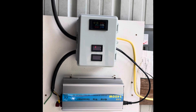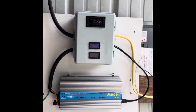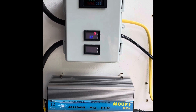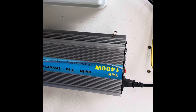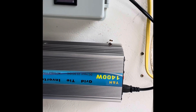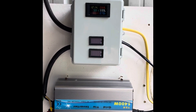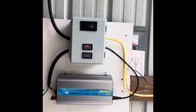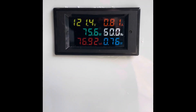In the future I had another setup here so I can get twice the amount going in. This will never overpower what's currently being drawn in the house, so it'll never be pumping back out to the power lines. This does have a safety feature that cuts off if it loses AC power from the grid, so you're not pumping power back into the grid with the power out. This thing also totalizes the kilowatt hours.